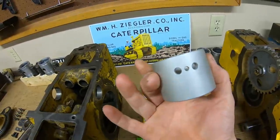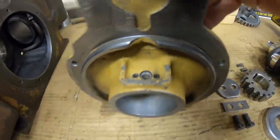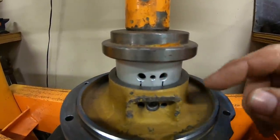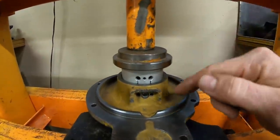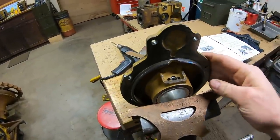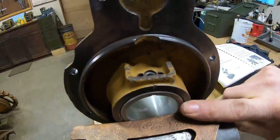I'll start with the rear main bearing because it's the most straightforward. I've got to press it into the cover, and the only critical part is to make sure the oil holes in the bearing line up with the oil holes in the cover. I like to use a square and a sharpie marker to put a couple lines down the outside of the bearing centered up with all the holes, and draw corresponding lines on the inside. You just line everything up and usually everything drifts together just the way you want it. Out of the press and into the vise. You can see all three oil holes are lined in just perfectly.